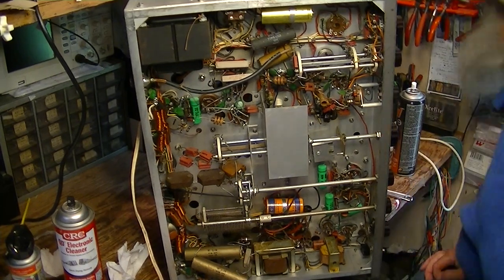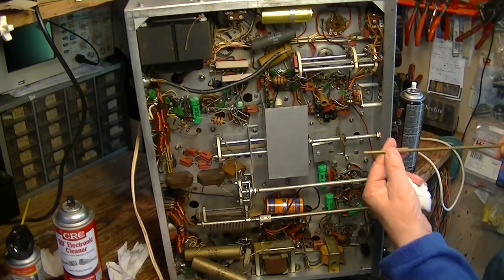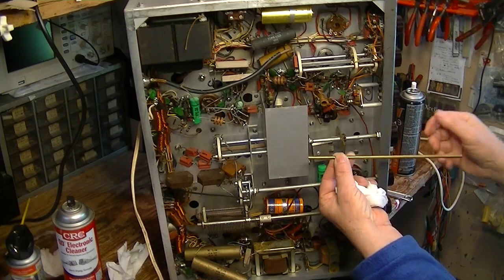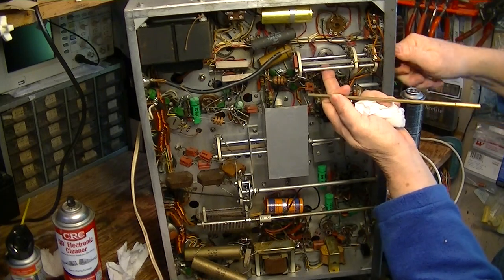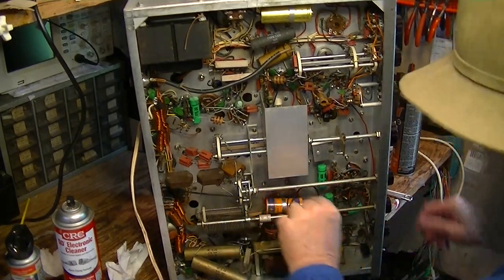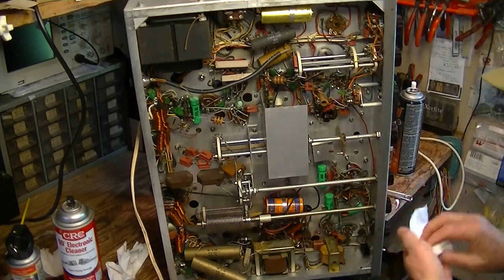So you want to find out if you're going to have to do something like that. If you do, you get a piece of brass tube and you can make a new shaft. These shafts for the wafer switches have flats on them, so you've got to get one of those from another switch. But these round shafts you can fabricate. I've done that on Globe Kings and Globe Champs and I've done it on Valiants.